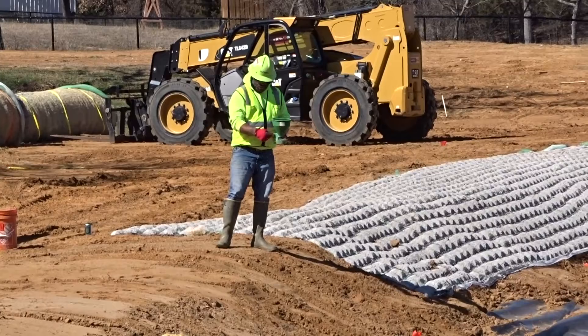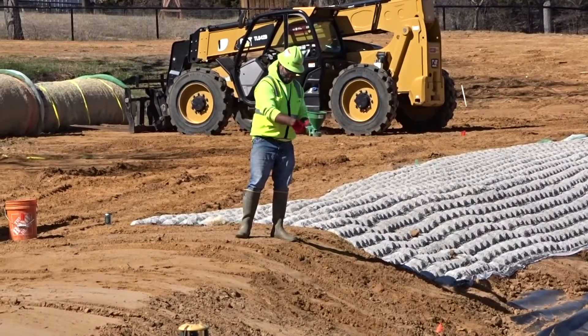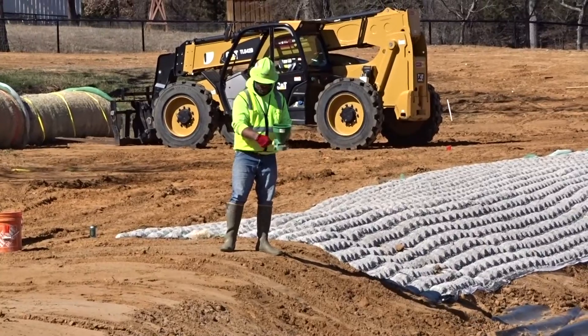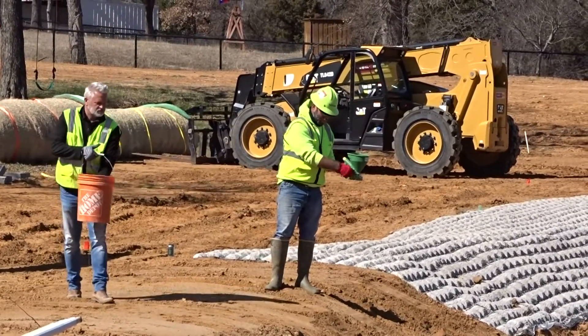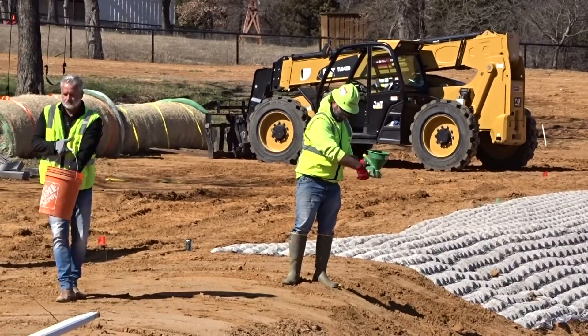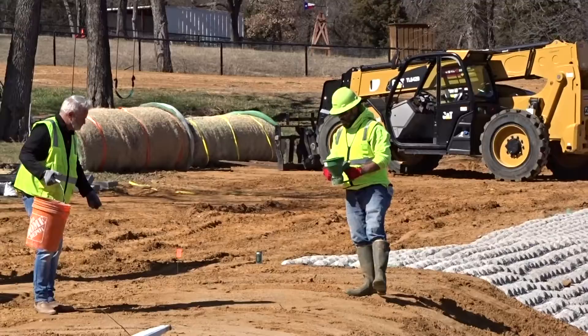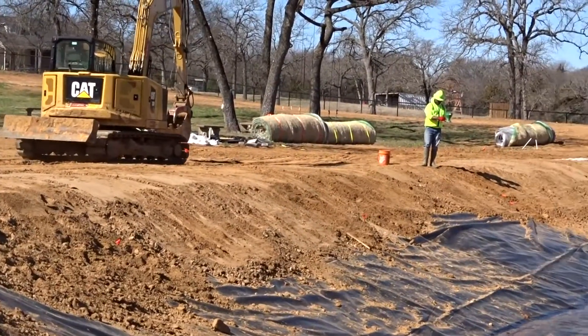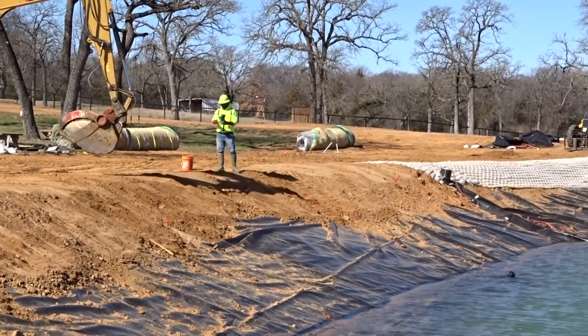Next, we add seed and fertilizer to the soil surface. The spaces in between the concrete blocks within the Fleximat allow the mat to actually be flexible, but also for grass to grow up in between each block. The grass growing adds an extra layer of stability from the roots holding the soils together.